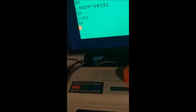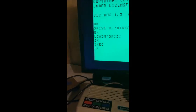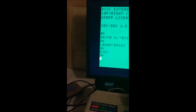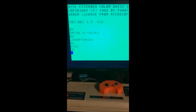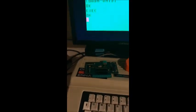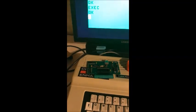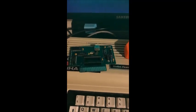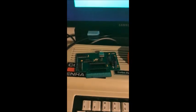The reason why it's not going to cost more to do that: I've ordered boards on OSH Park, and it does not cost any more to add more lines to your board. The cost is in the size of the board. Secondly, it doesn't have to cost more as a kit to buy because you don't have to include that stuff. Those are all options that we as developers can just add our parts to this board. If we want to have an audio out line, it's up to us to put it on there. It doesn't need to be there to function, and neither does that cap. It's only there if you want to use that audio line.